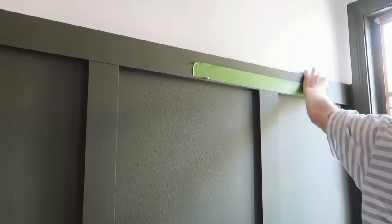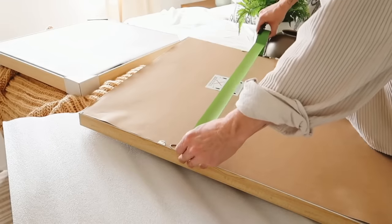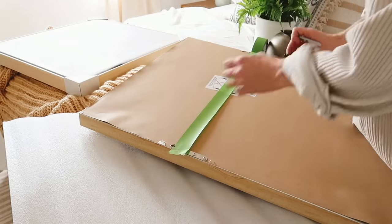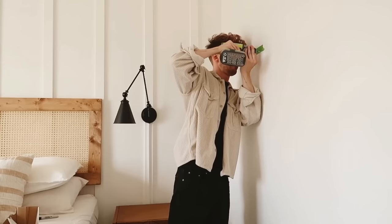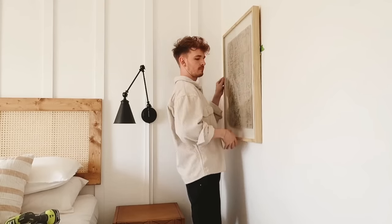You're essentially allowed to nail holes directly over the top of your tape, and that gives you perfect placement for your picture every single time. This also works if you just have one hanger in the middle — put your tape across, cut it to the width of your frame, mark where the hole's going to go, transfer the tape to the wall, add your nail hole, and you're good to go. When there are two picture hangers it traditionally means the piece is heavier or larger, and using this process also makes it a lot easier to hang solo. It's just something to keep in your back pocket next time you're hanging a mirror or a large piece of artwork.